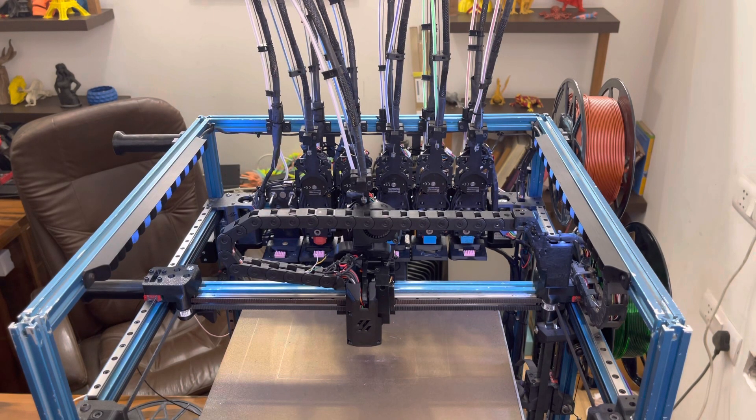The first one will be an error while dropping off. I will hold the carriage to make it skip some steps and not be able to dock correctly, and then we'll see the tool changer take corrective action. So let's start off with that demonstration — I'm just going to do a tool change from T0 to T2 and hold the carriage.